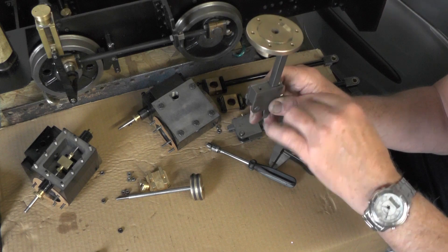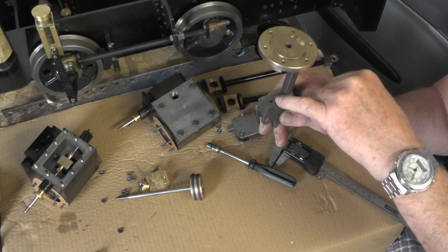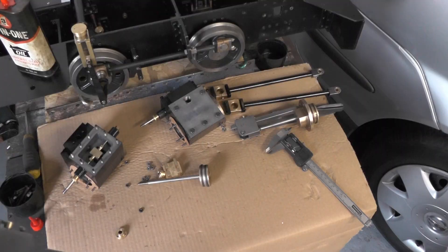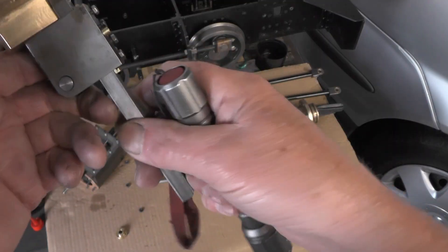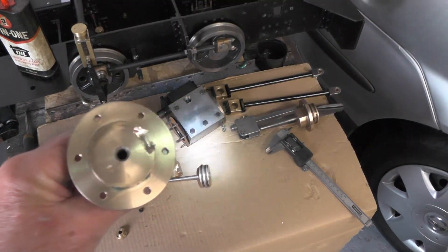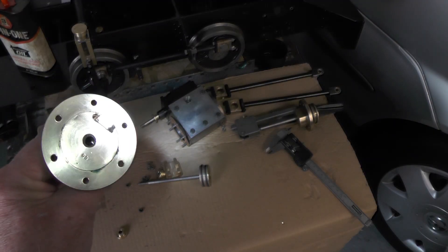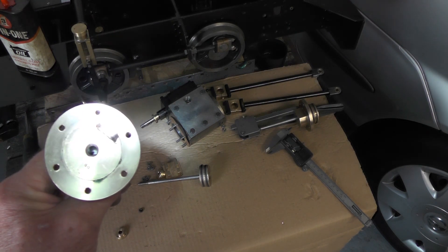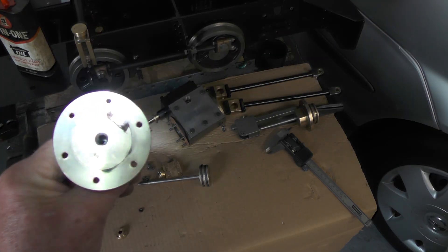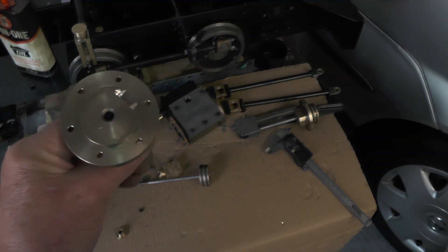I'm not going to make the whole job lot again. I'm going to drill this hole out to a suitable size for a plug, loctite a plug in, and then do everything again. I don't know if I'm going to be able to get you to see this, but that's the position you need to be in with the cross head and the cover. When you look down the bore where I've done my hole — I've just slightly drilled it out of position. You might just get a glimpse — anyway, you get the drift.